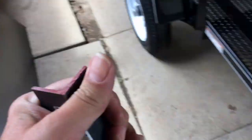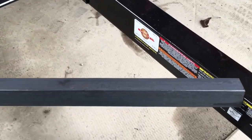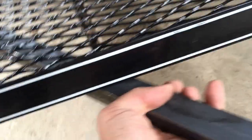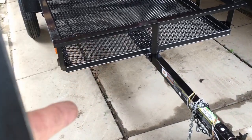The first thing I'm going to do: I got some 36-inch angle iron. If you push down on here you can just see it all twisting, because you got a single bar and it just twists. So to firm that up on both sides, I'm going to take this angle iron and weld it underneath here to give it an A-frame type deal. It's all flat surfaces so I don't have to cut any angles — I'll just lay it right on there. I can weld up under there on each side to make a stronger A-frame tongue so it won't bend as much.